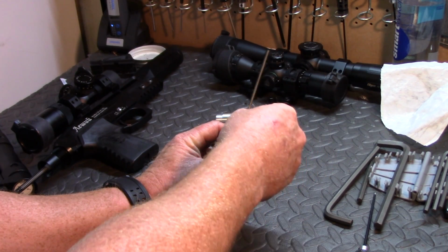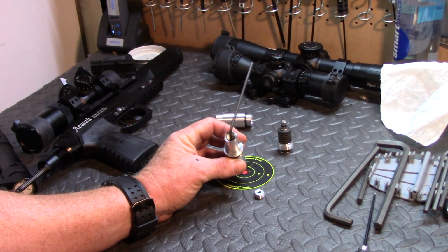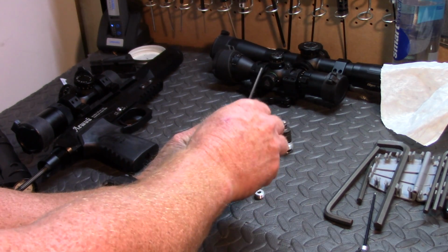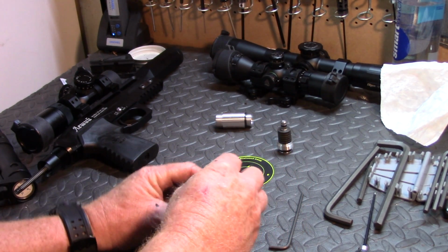With a right-handed Allen wrench, like a clock face, put it at 12 o'clock, and for every 30 degrees of turning, you're going to decrease it about 10 bar. So 60 degrees will turn it back down to 110. 110 seems to be the best setting for the 25 so far.